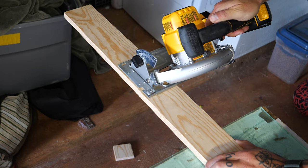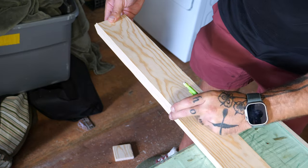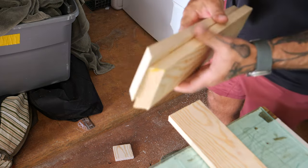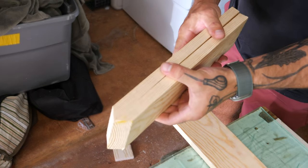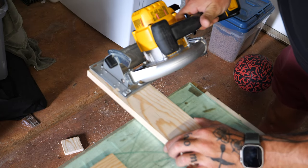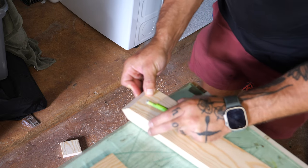We're just measuring 15-inch lengths — square on one side and mitered on the other. It's easy to use one as a template for the other. Right after that we're going to make the inside of the jaws — these are about three inches, they're a little bit big, so you can actually do two or one and a half. Just make one and then use it as a template to make the other.